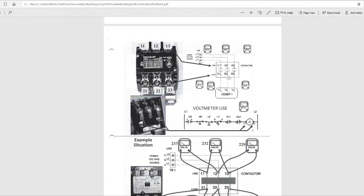See, this is a schematic. We're going to break it down. This component right here will be on a schematic diagram. Right now the switches are showing that it is open. So if you have a thermostat at the house or wherever, you're not calling for cool right now. If it's 72 degrees inside and your thermostat is set for 74 degrees, the contacts will show open.